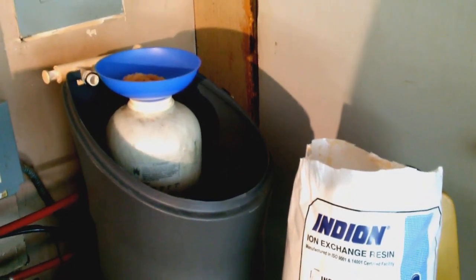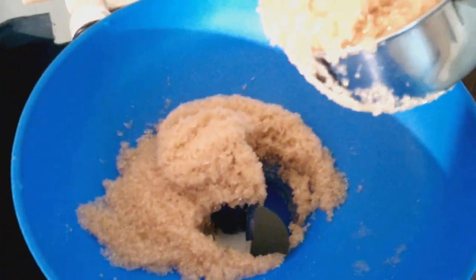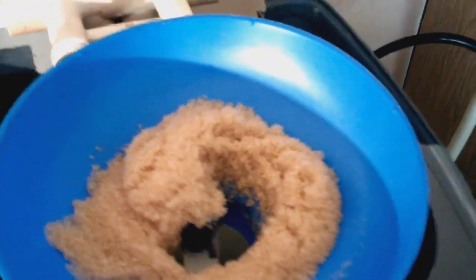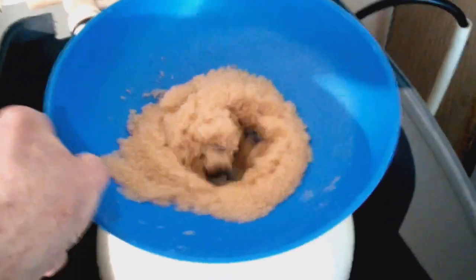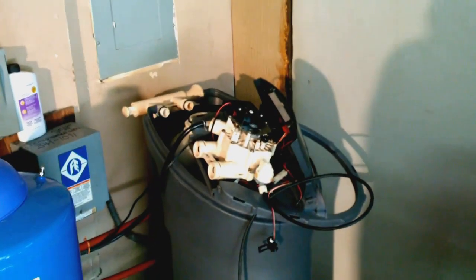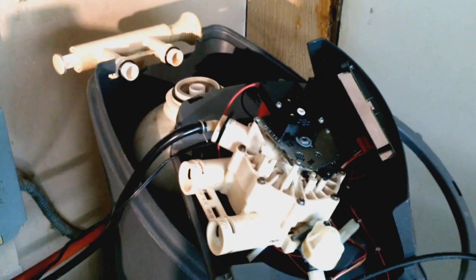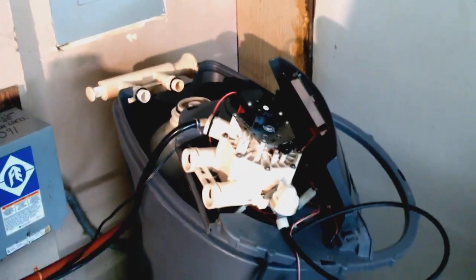The gravel is in the ion exchange column of the water softener now, and I'm putting in the new resin. It sure is a lot nicer looking than the resin that came out — the old resin was kind of a dark blackish brown, and this new stuff is a nice tan brown. I think we're going to have some pretty soft water with this beautiful new resin. We're going to finish filling up the tank, probably about three-quarters of the way — I actually went up a little more, maybe about five-sixths of the way up the tank. I've got the head unit to put on and connect a few wires, and we'll see if it works. Here we go putting the water softener back together.